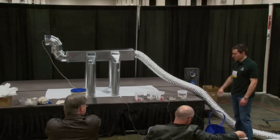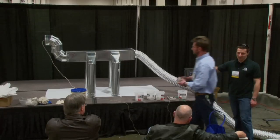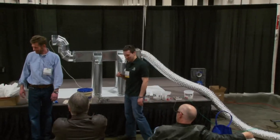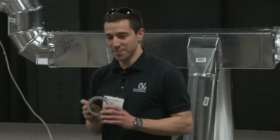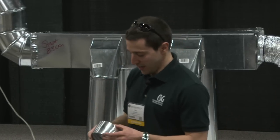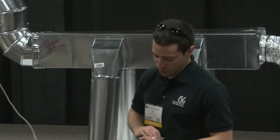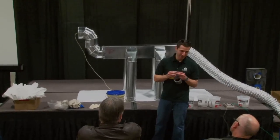There are some forms you don't see because they do it from the inside of the ductwork. Today we're going to show you straightforward with just a mastic. The two forms that we have today are a butyl tape — this is butyl backed. You don't want to use duct tape on ductwork because it's going to fail. It heats up, it cools down, it falls off. This type is designed specifically for it. It's a two-part kind of tape. You peel off the backside and then the stuff doesn't come off.